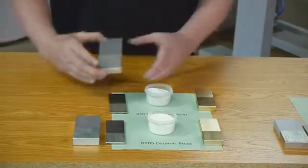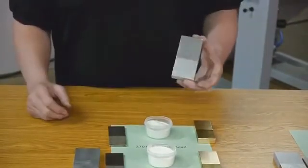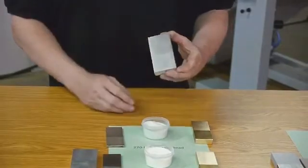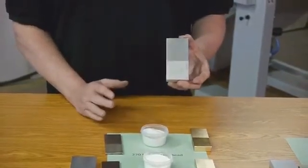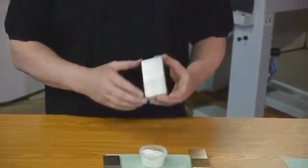So as you can see here, this is the substrate, which is just bar stock, so it's kind of rough, but you can see the shine that you're going to get. And aluminum is really popular for the CNC machining shops. We can take out the tooling marks, and we can deburr, and we can leave that finish for anodizing.